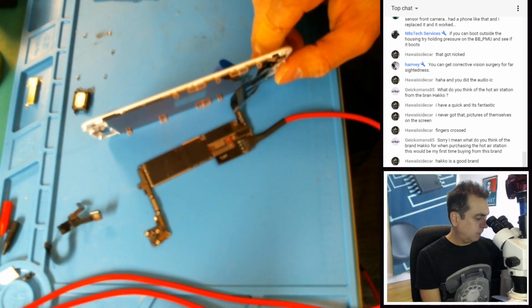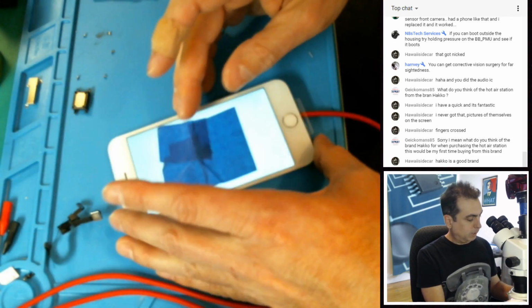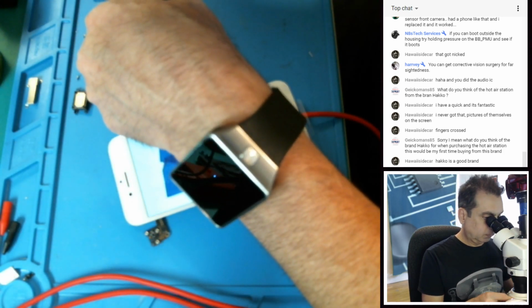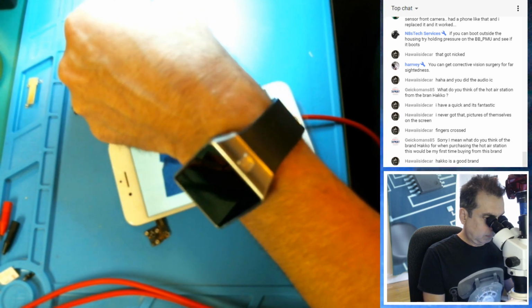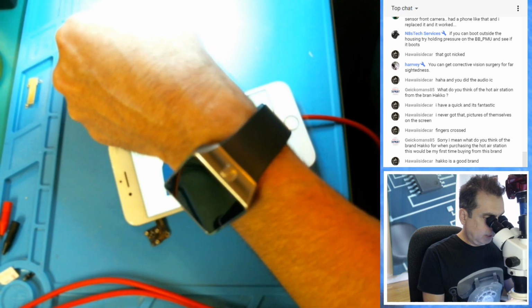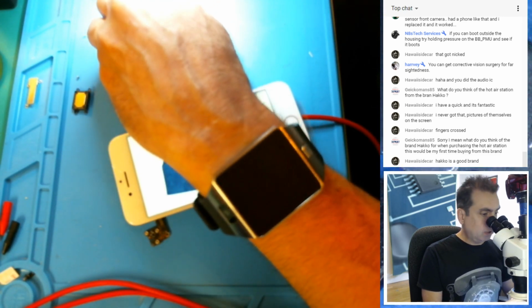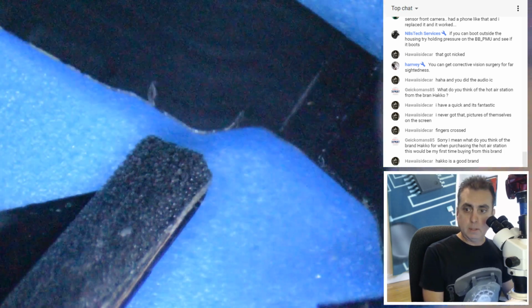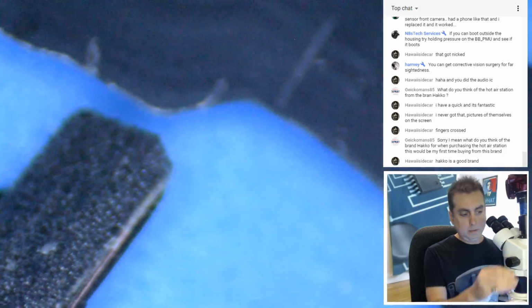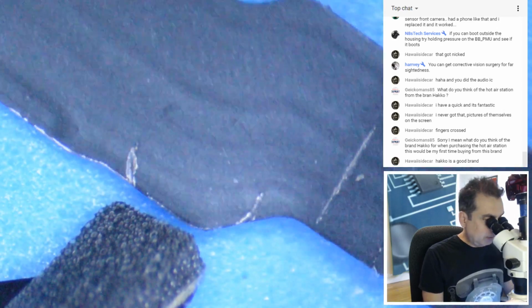Disconnect front camera, reboot, and meanwhile, I'm going to look at this camera under the scope and see if we have anything happening that we need to be aware of. I don't see anything obvious. Although the back side has a couple of nicks. Oh, you know what? Look at this. This looks like screw damage. That's interesting. See those cuts right there? They're almost round. You see that pattern? It looks like somebody kind of tried to put a screw or maybe push something on here too close.